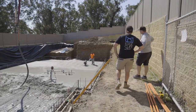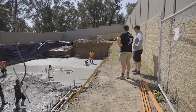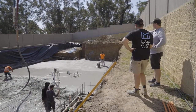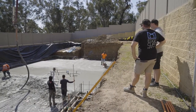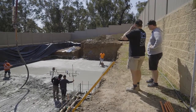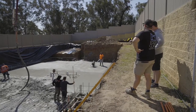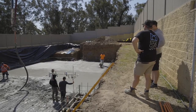You can see where the boys are up to now - they're on the heli. Over here you can see the recess section for your bathroom, because we've got to sand and cement bed it and bring it up to level. That's a similar situation in the alfresco area and courtyard area, which is also recessed down. You can see where the laser is sitting - that metal grate there. When it comes to tiling all the basement, that'll get screeded and then the tiles will go over that as well. It's a lid essentially. Correct.